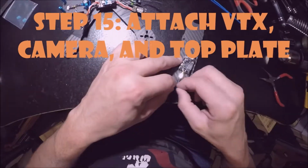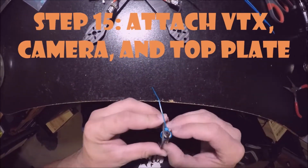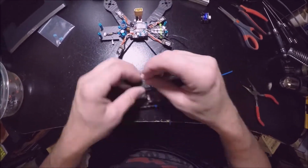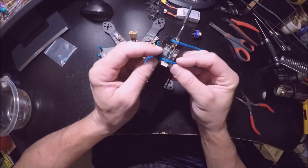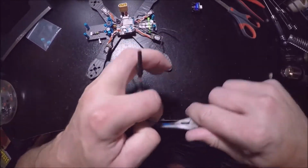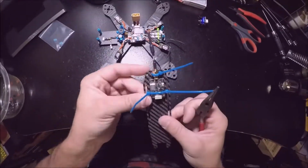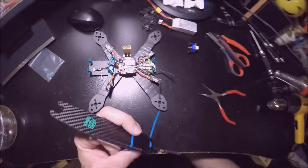So now we're moving on to step 15. We're going to be attaching the VTX to the top plate and putting the camera on. So now for this VTX, obviously I want to be able to change my channels without taking the quad apart. So I'm actually mounting the VTX kind of upside down. The back of the VTX is going to be against the bottom of the top plate. That way the LED and the button will be facing down towards the inside of the quad. So if I need to change my channel or something like that, I should just be able to look inside the quad there and get to the button to make the change.